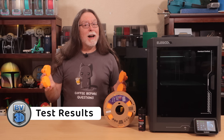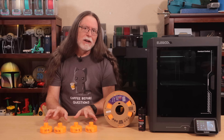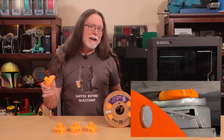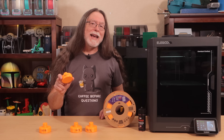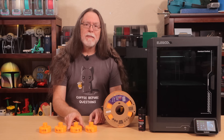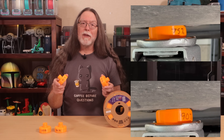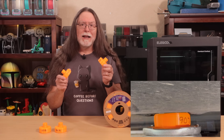OK, the testing was fun, but it's kind of hot out there, so I'm happy to be back inside. Here are the results. 25% is a squishy failure — it didn't break, but it also didn't look like it was up to the task at all. 50% is OK-ish, but still squishy. It was a bit skewed, and I didn't feel like I wanted to put the whole weight of the car on it. 75% and 90% both work really well. They were able to support the weight of the car with minimal squish, with the 90% infill one exhibiting the least amount of squish as expected.